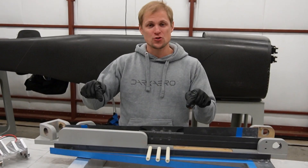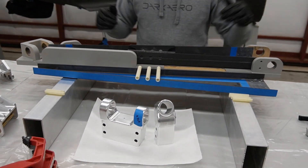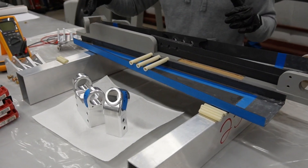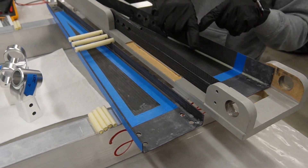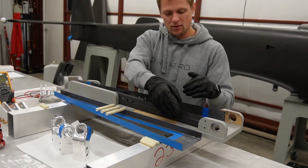We're looking at all the pieces for the strut assembly. This is all staged, and we're preparing to bond it together. We've had the bond areas masked off and solvent wiped the bond areas, and we're basically ready to apply adhesive. But there's a lot going on with these struts internally. We're looking at the two strut halves here — there are a couple strips of carbon fiber that sit both internally and externally over that seam.